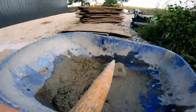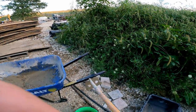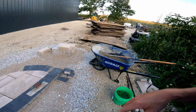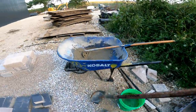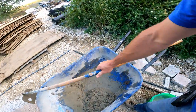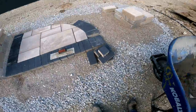We've got it kind of mixed up — I'm happy with that. The key is not adding too much water right out of the gate. By the way, on paver jobs make sure this concrete waste goes straight to a wheelbarrow or trash receptacle — not on the ground for someone to double-handle later. That's a big deal. We're going to take the shovel — your shovel will already be dirty — and work the concrete in close to our work area.